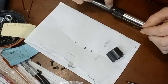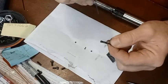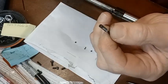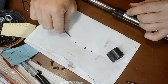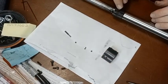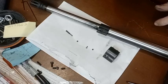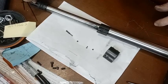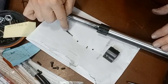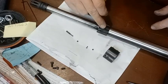My suspicion is that the screw on my AR-10 doesn't come down low enough, which is why it stops at 12. Palmetto sent me a complete gas block, but I don't want to change the entire gas block — that means removing the flash suppressor and disconnecting the gas tube. I'm fairly sure the problem is with the screw itself, so I'm just going to swap the screw.